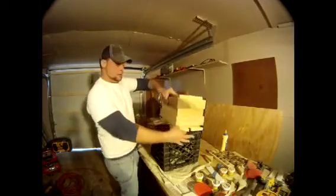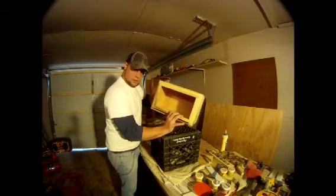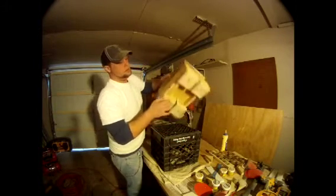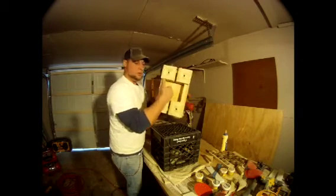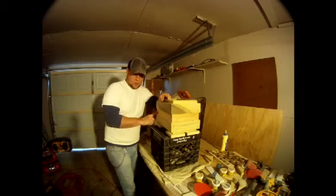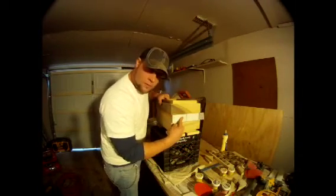Let me run by what wasn't shown. You had the initial box on the inside here. And then we had these pieces here. And this piece ran an inch longer than the box. This is a 2-inch gap. This is a 2-inch rip down of the 1/2-inch ply. For that to fit.